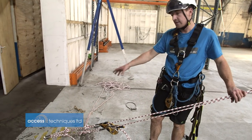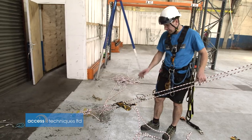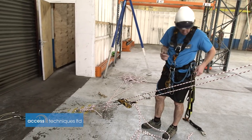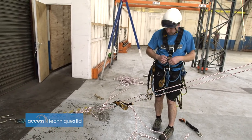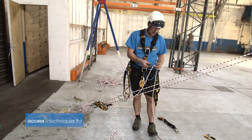These are now equalised into both anchors. I just need to put a bit of tension in them now — I don't need to go crazy. You don't gain a lot from putting a lot of mechanical advantage in. You gain a couple of degrees in height so there's just no point in it.